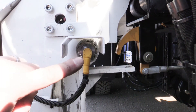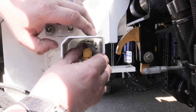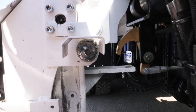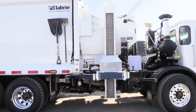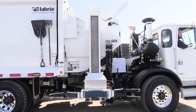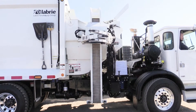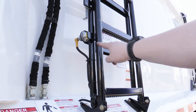Next we move on to the grabber auto-close proximity switch. This switch is located on the opposite side of the grabber head. It controls two functions: one being gripper auto-close, the second being our bin counter, which is displayed on our MDM. Failure of this switch to function properly would cause the grabber fingers to come into contact with the hopper. Excessive air gap on this switch, combined with normal vibration of the vehicle through operation, can cause multiple bins to be counted for each one lifted.